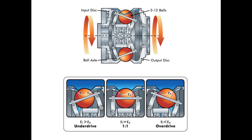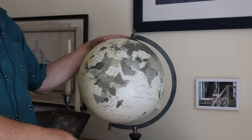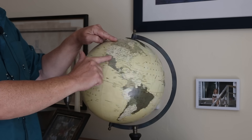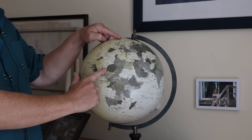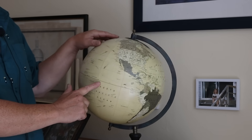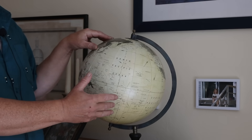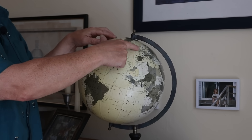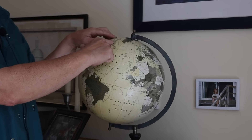Using balls like this you're very close to what's called the NuVinci machine. The NuVinci CVT works on the idea that the balls have a different radius depending where you are on the ball. It's perhaps easier to see that on something like a globe. If I'm here at the UK and I want to go around the globe I have this distance to travel. However if I happen to be somewhere on the equator like Colombia then I have this much to travel and clearly it's a greater distance. It's why aeroplanes don't fly this way — they fly that way because the distance is shorter. It's called the great circle.